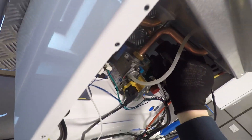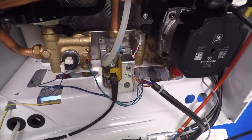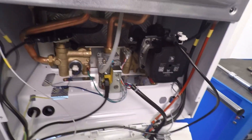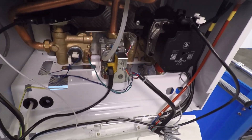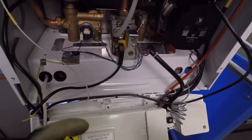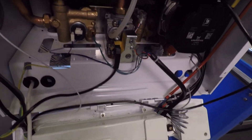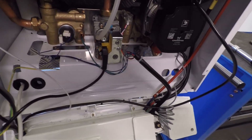What I'll do now is take a hydraulic inlet assembly out of a turbine-type one as well — out of a 600 or an 800. So give me two seconds, I'll go and grab an 800 and we'll have a look at the difference. We'll have both of them on the table so we can see the spring type, the float switch or bobbin type, and the turbine type as well.